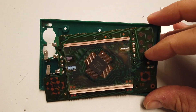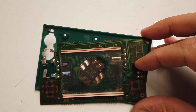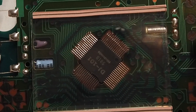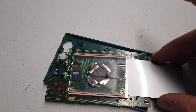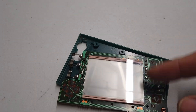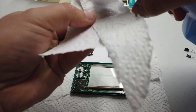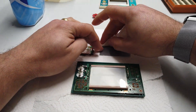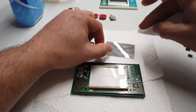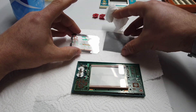Now you can look straight through the LCD display and see the microchip — that is an ASIC, an application-specific IC for Nintendo, a QFP — a quad flat pack. Very interesting stuff. I've given this a really good cleanup. We'll slide that back into place and use a little bit of non-streak window cleaner to clean the glass very carefully. This is the polarizing filter, so let's go over that and see if we can clean this up.